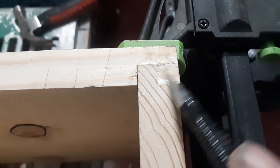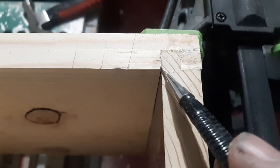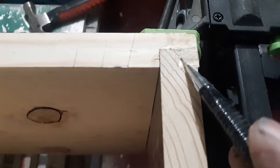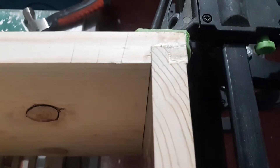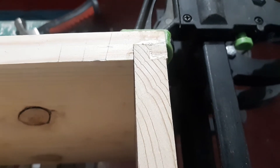Cutting all that off, now it's support area where you've got glue surface area. You've got three-eighths, three-eighths, three-eighths, three-eighths — it's an inch and a half versus an inch and an eighth of glue surface area, provided everything works out well.